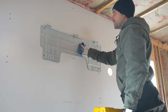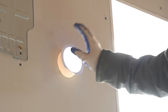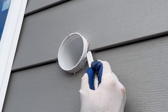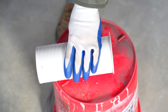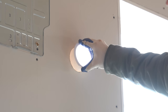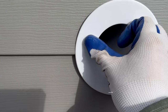I'm now going to place this sleeve through the hole and mark the length it needs to be cut down to in order to fit flush to the exterior. For a two-by-four wall, you'll have to cut a good bit off. I marked it with a pencil at one of the cut rings and used a Sawzall to cut it to length. Then I slid the sleeve through the hole, went outside, and placed the trim cover into the sleeve for a nice finished look.